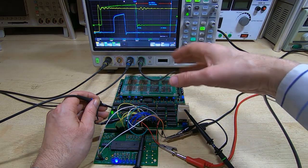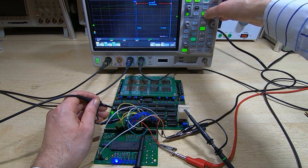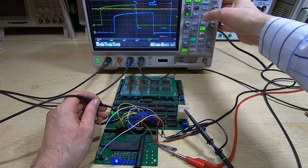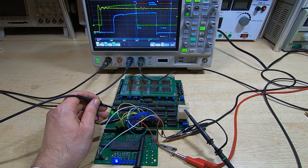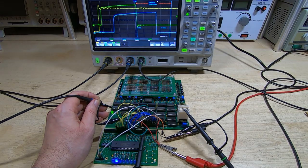And because this is going through a whole range of values, if we keep doing single captures, then we'll see that we randomly will detect either a 0 or a 1. So this is of course a 1. If we do a few more, that's a 0, a 1, another 1, a 0, 0, 0, 1. So you can see we're capturing single events, but to go through this and try and manually capture every single permutation would be pretty much impossible.